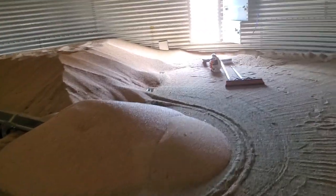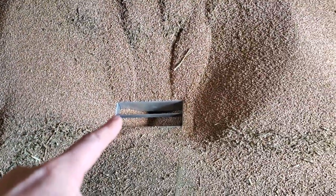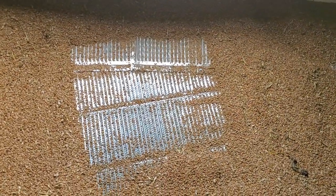As I mentioned in the previous video, there's an in-floor auger. It starts in the center and runs below the floor. There are three sumps — one in the center where grain can get down into the auger, and two intermediate ones. The floor is perforated so air can get up into the grain, and the big fan outside puts the air under the floor.